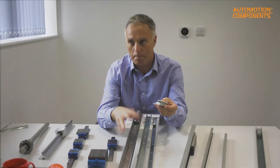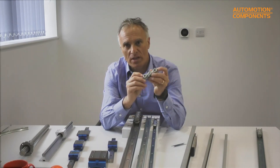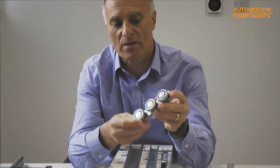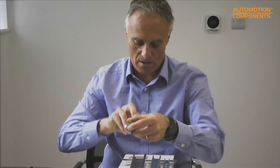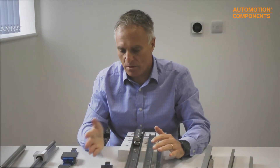This one here is in 316 stainless steel — great if it might get wet from sea water. The standard zinc-plated version has 2Z seals and is not intended to get wet, but the stainless version has special rubber seals. That doesn't mean you can fully submerge it, because the bearing contains grease that would wash out over time, but getting it wet from time to time is not really a problem.